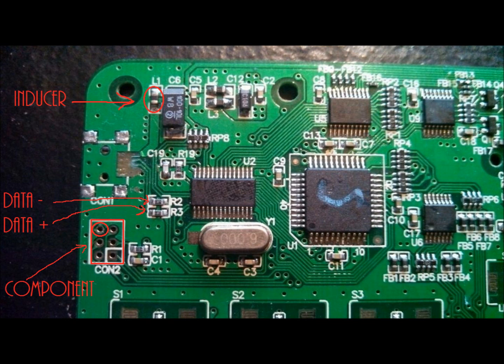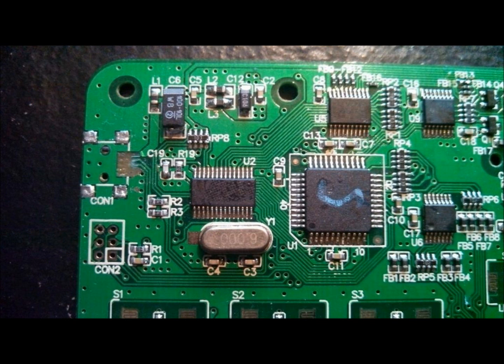And so let's go ahead and get started. So now that I've explained to you what these little components on the board mean, I'm going to show you how we're going to actually hook up your wire into the Korg nanoKontrol. You can see on the L1 we are going to put in a red wire. We're going to solder this right down. We're going to do this for each of them. We're going to solder the contents of the red wire onto the L1.